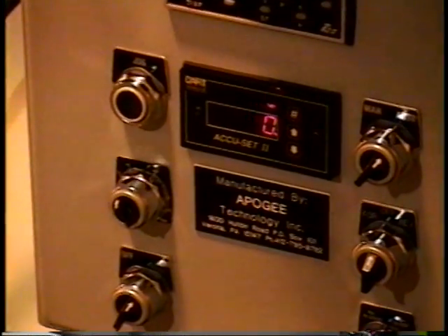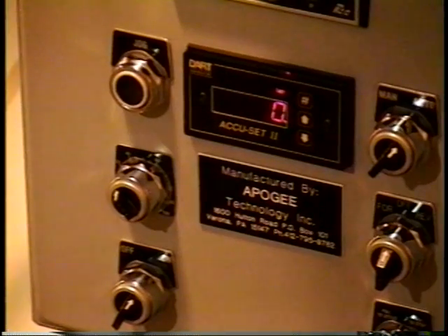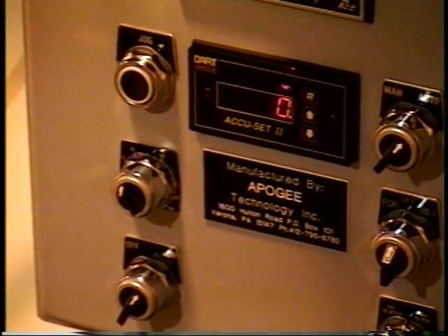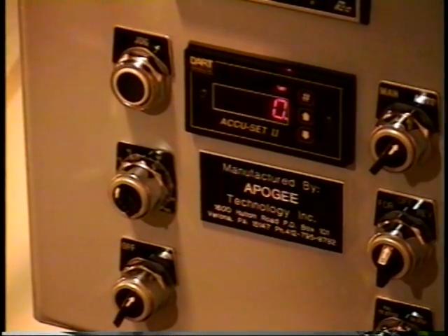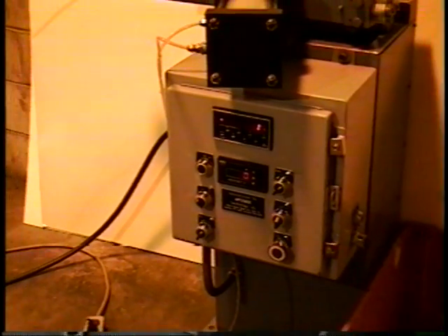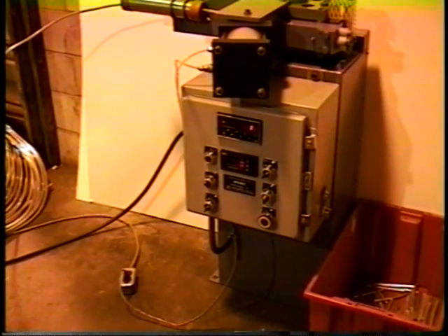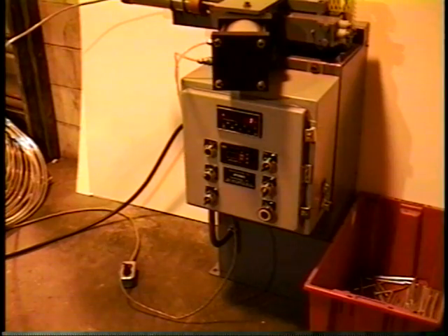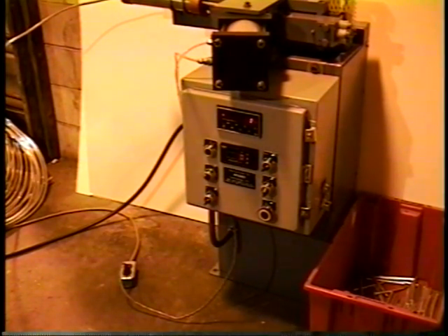The operator is establishing a set point — not, as in the case of other rod feeders, using some type of drive in a variac controlling actual voltage or current to the motor. The top unit is a multifunction display that is independently driven from a pulse encoder that's an integral part of the feeder.